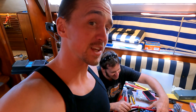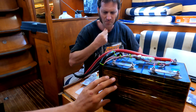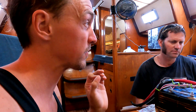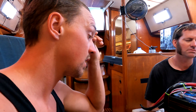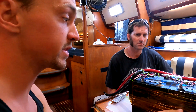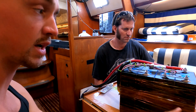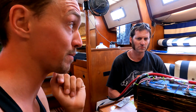Arky sparky has been the word of the week here on the boat. Look at it. So here's a quick breakdown of what we're working with. We have four cells put into series. Each cell has a voltage of about 3.29 — that's what they're at right now. The nominal is 3.2, but they will go higher than that. We actually saw the lights in my boat get brighter when we switched over — everything's brighter today. Back to technical.